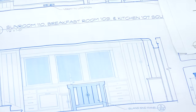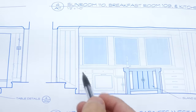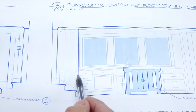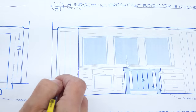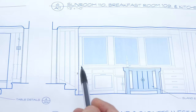Okay, going on around to the other side of the cabinet. Whoop, there it is right there. So it goes right into those steps there. We're going to have the same sort of calculation with the stiles. We have the lap joint over here, so we still want a 4-inch show. So we'll take away the face frame. Back here we have a 3/4-inch thick casing. So I'll add that onto this one. So this back one will be wider so that when that casing drops on, you'll see 4 inches.